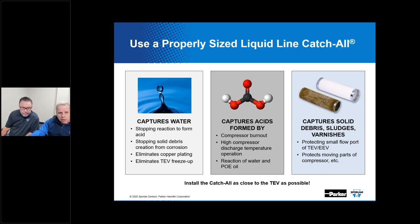Now, foreign matter originates from a variety of sources, like we said earlier: oxide, scale, metallic fines, fibers, and the list just goes on. This stuff can be introduced into the system during assembly, construction, or service. And keep in mind, some of these lubricants, like POE, do a really good job of suspending and transporting large amounts of debris if it's in the system. POE is also a reasonably good solvent and has a scouring action, and if there is stuff that's plated out, it could possibly break that loose, and then you might have sludge and varnish as byproducts of lubricant decomposition along the way. And even waxy substances can originate if you've got a low temp system. We still see that on occasion, maybe not as often as in the era of CFC refrigerants, but it still does take place, if I'm not mistaken.